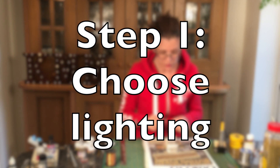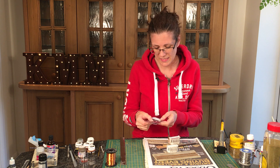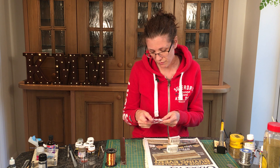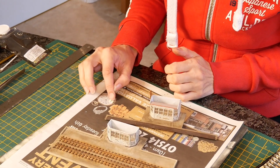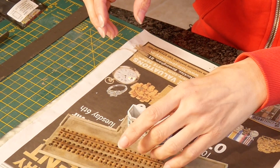This week we're looking at how to light a simple plastic building. There are a number of ways, but I would personally always use an LED because they last longer and they're easier. I get them on eBay from LED Baron in Germany, but there are thousands of different sources. This one is a 3 to 3.1 volt LED, a sunny white mix - I like sunny white - and they're about this size, so they're easy enough to mount inside a small building like this.